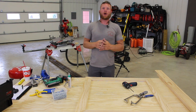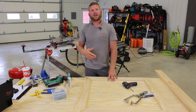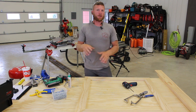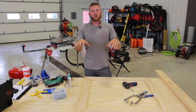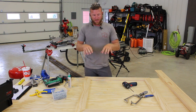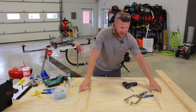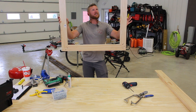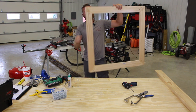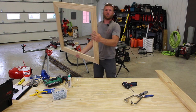Go ahead and make it up on a table where you can do it efficiently. It's really no different from the way I build my buildings — all on the ground, then stand them up. It's always easier to work where it's more comfortable, and this is far better than holding your casings up at the window trying to make everything line up. Now you can take your window casing, go put it right where your window frame is, and tack it up. It's that easy, and it's going to be a super strong connection — I don't have to worry about these joints opening up over time.